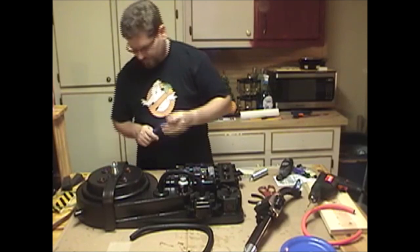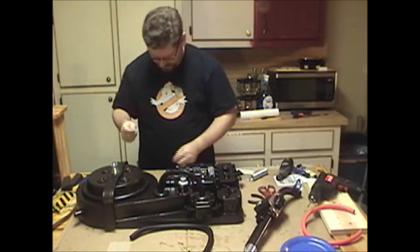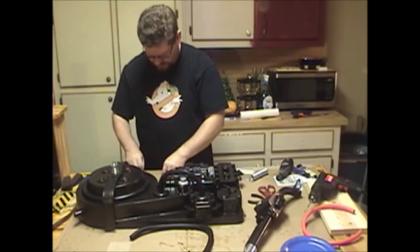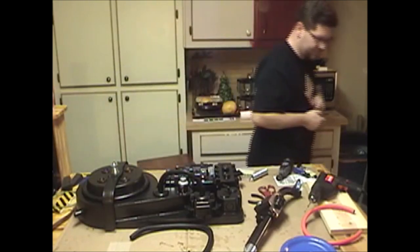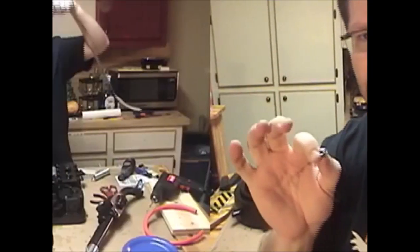There we go, that's on. Now the way I'll attach it on the sides is I'm actually gonna drill and put in a little anchor and then a screw. So here, again, I'll bring that up to the camera. Gonna drill into the side, into the wood, the 3/4 inch plywood, insert this anchor. With that, I'm gonna put in this little metal screw, and to keep it from going through the PVC, I have this very fancy kind of ring protector that's gonna go in. It's gonna stop the threads from going all the way in. And you only do just a snug fit.